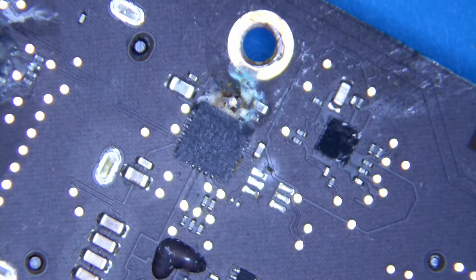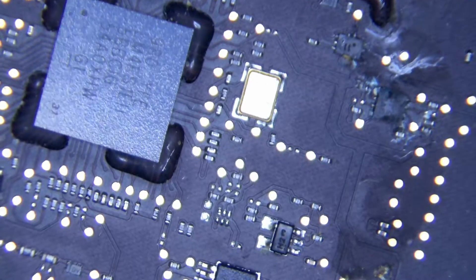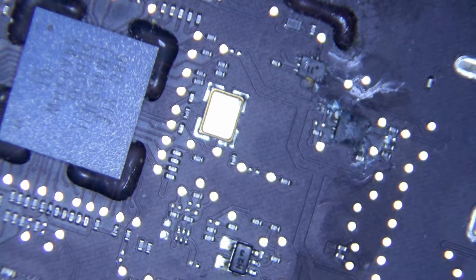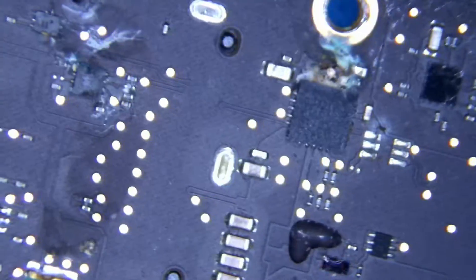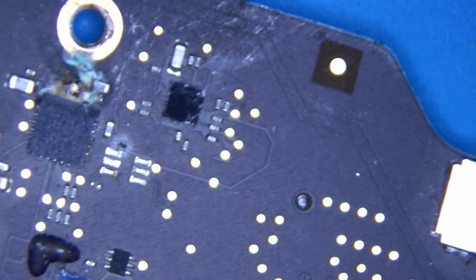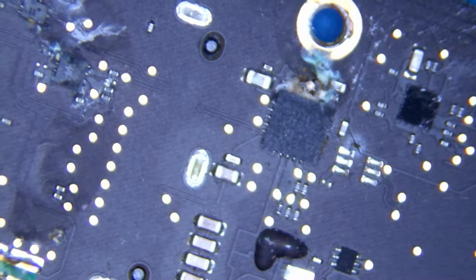So we're going to continue the scan, because we want to take mental notes throughout this whole area. Especially if we're going to go through an ultrasonic for cleaning — it's always good to know where the damage is in case there are other spots. There's a lot of damage, but it's just more surface damage than anything else. Nothing looks to be totally corroded. Maybe the pads could get a little damaged, or some trace lines could get blocked. Maybe the machine turned off quickly and some corrosion just blocked the circuitry and electricity flow.